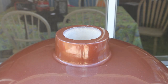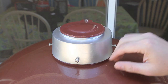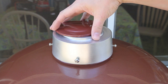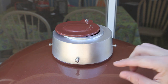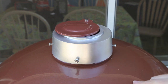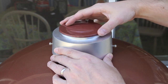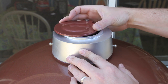Now we're going to place the ceramic top with the stainless steel components right on top just like this. You can see we've got some stainless steel down here, and then the ceramic lid on the very top. All you have to do is tighten four screws here until you feel just a little bit of tension. That's crucial because if you really crank down on that thing, you crack the ceramics. So you just tighten all four of those up, and then there's this one screw up on top — tighten that up too, because if not the lid just flies all over the place.